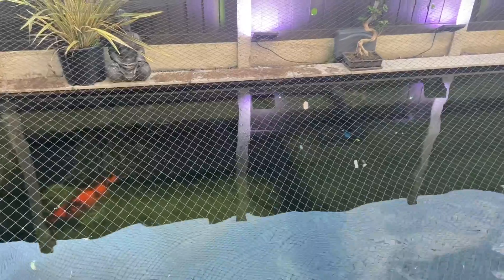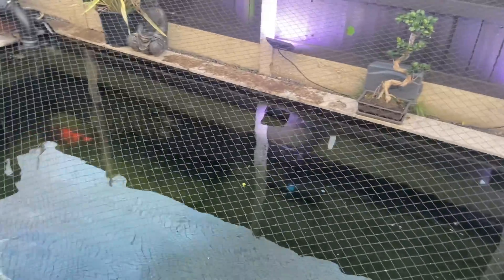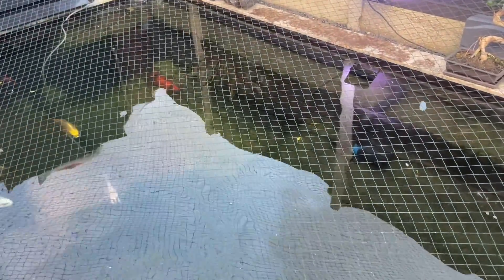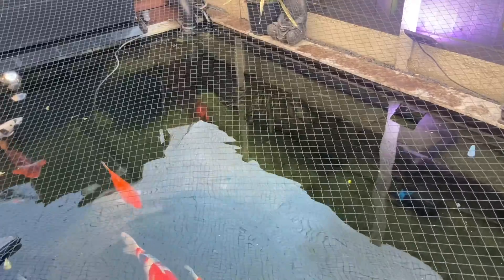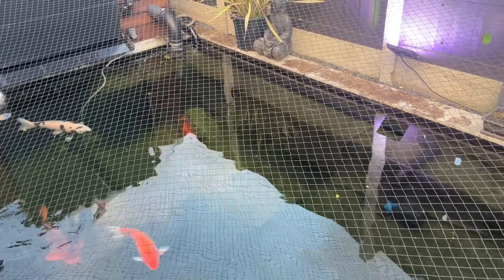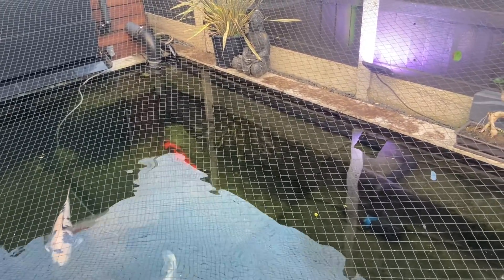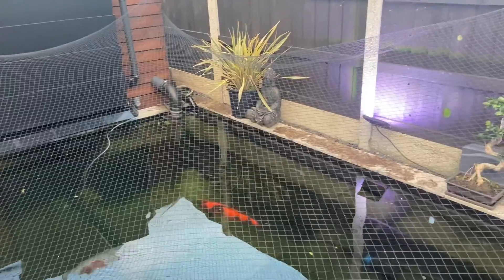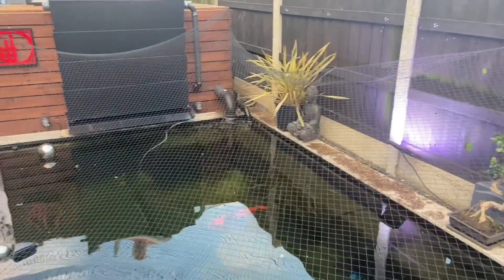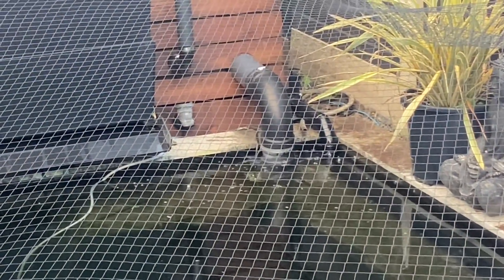I don't know if you can see through the net, but I've cut all the pipe work down and welded it all together. The part connected to the pump is friction fitted, and the rest is all solvent welded together. As you can see, the pipe now is much neater running down - put an elbow there, another elbow down there, a couple of elbows there, and nice and neatly into the pond. Before, there was a big massive black pipe sticking half way up - now it's nice and neat.